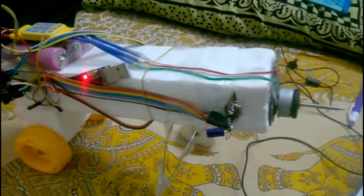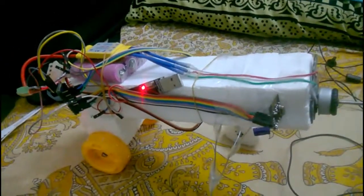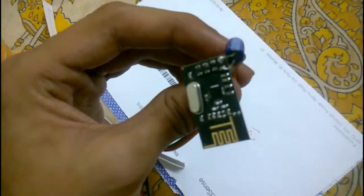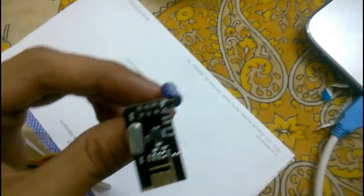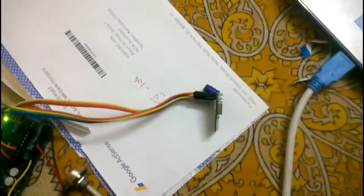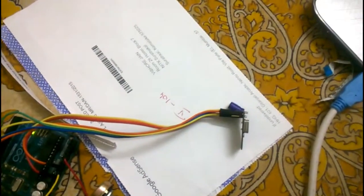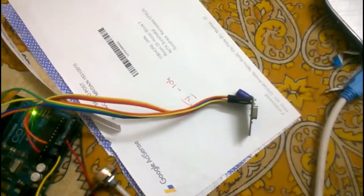That's pretty much it — there's nothing else to explain on the transmitter side. I also have an NRF module but I'll be upgrading to a module that has a PA — a power amplifier — with an onboard antenna, so that will increase the range. I'm thinking of getting close to 150 meters of range because I'll be making a park flyer and won't be flying very high.